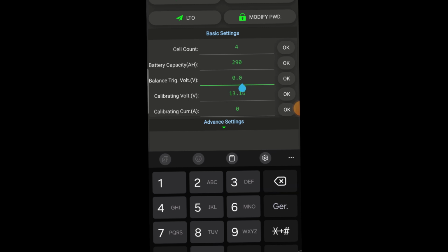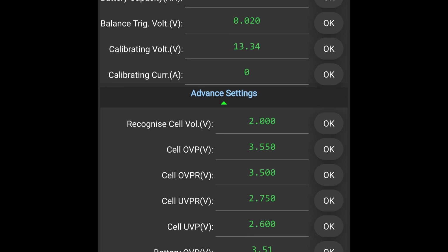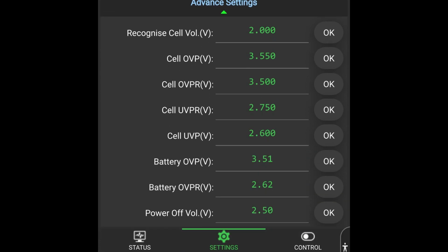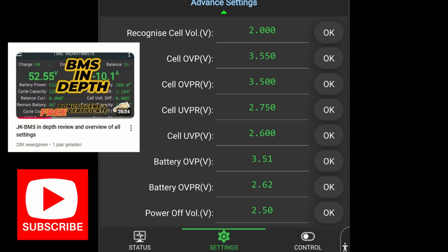I never start balancing when voltage difference between cells is less than 20 millivolt. Before changing advanced settings, select the correct technology. Choose LiFePO4. Very important, if you click another technology, all settings will be overridden. I will not go over all settings. There's a cheat sheet available free for download. As mentioned before, there's a video on my channel where I test and review this BMS. Both links will be available under this video.